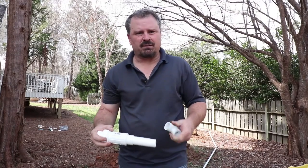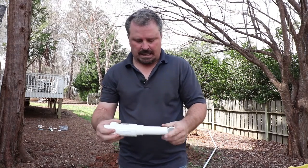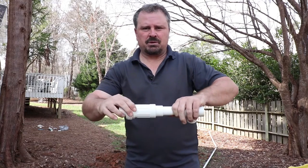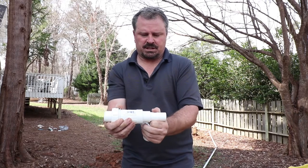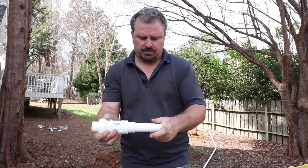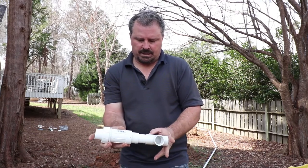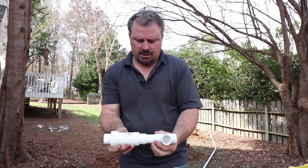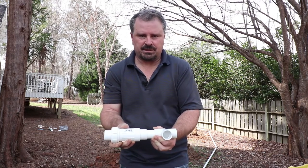That main pipe in the trench definitely won't bend to allow me to put in a T. So I have this expandable coupler — it goes like that, and then you just expand it into the spot. What we'll do is put our T onto this piece, cut out a piece this width out of that main pipe, and then glue it in by spreading it out into the gap. It's pretty sweet.